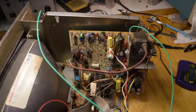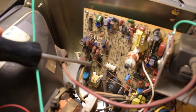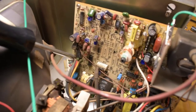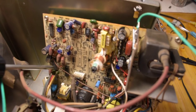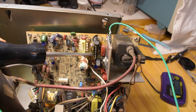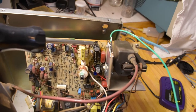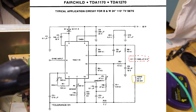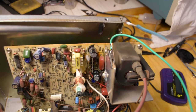This is the monitor that I haven't fixed yet. But from what I saw, this IC there with the two thermal tabs — that's a TDA1170 and it's a vertical deflection amplifier. The deflection signal goes underneath the board and ends up on this connector here, which goes to the yoke. The yoke coil is in series with this capacitor, and that's the one that was bad on the other board that I fixed. It measured open circuit — just no capacitance — so maybe dried out.